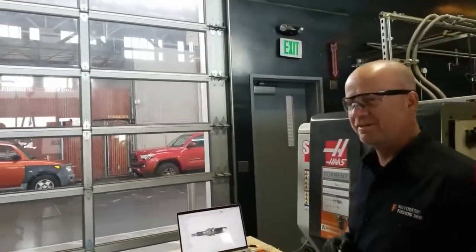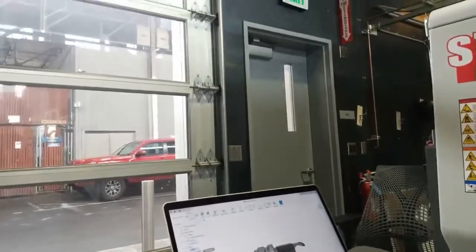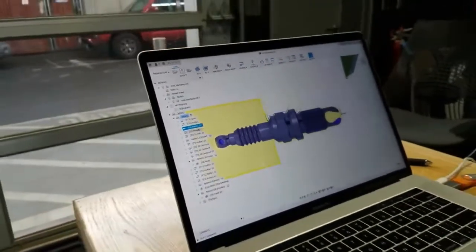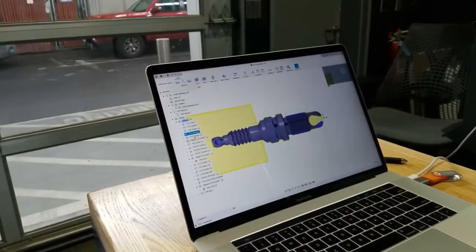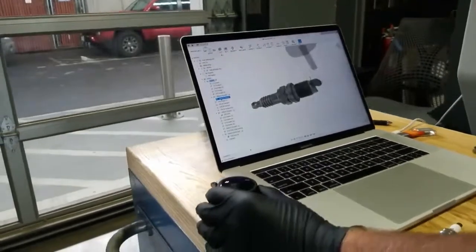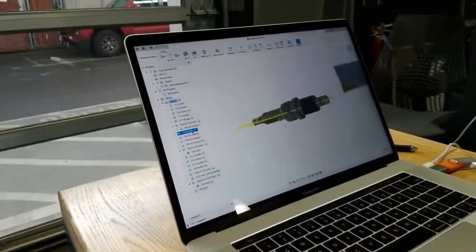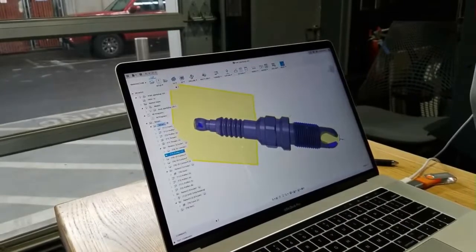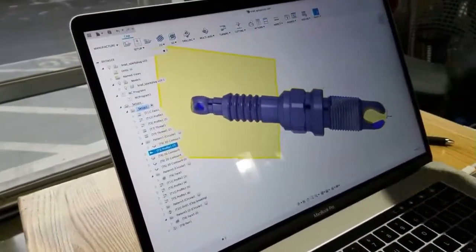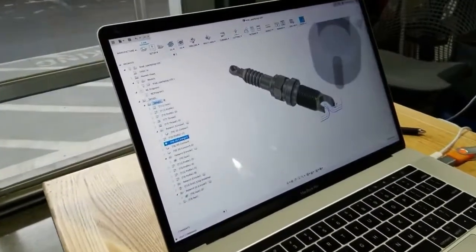So if you remember the other day, we assigned some tool paths. I did change some of the ordering on some things, but we got the facing, and then we profiled and came down in these areas here, and I got some threading. Let me open this one up. Here I machined the flats, so you can see that there, and then I just did a circular pattern, so it puts it on both sides. And then after that, I did what we call a spring pass to clean up all of this area here. After you do some turning and some of the milling features, it kicks up a very slight burr, so I just trace over it really quick. And then over here, I cut out the bottle opener portion.